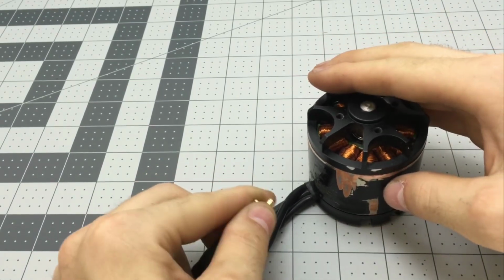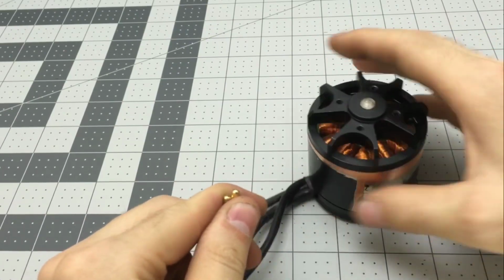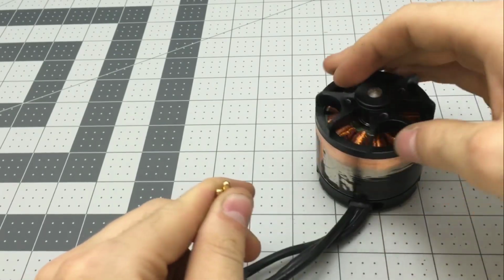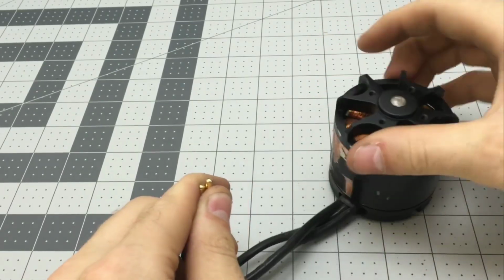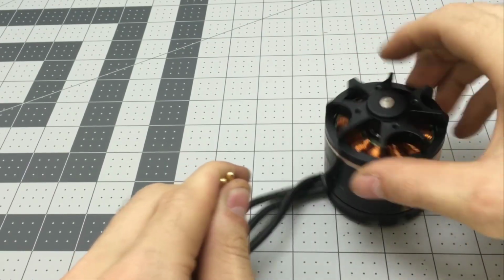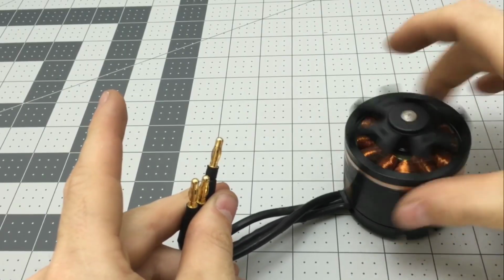The motor now becomes very hard to turn because the electrical load causes a physical load on the power source, me. You didn't think the energy came from nowhere, right? We are just transforming my kinetic energy into electrical energy and then into heat. And if I connected the leads through a load with a lot more resistance, less current would be able to flow, and thus less power would be consumed and the motor would be easier to spin.